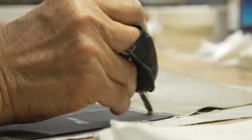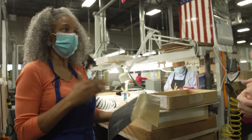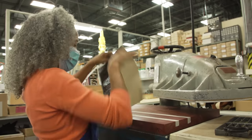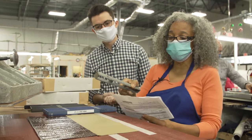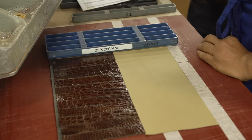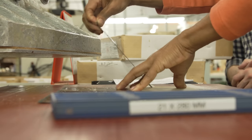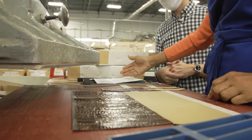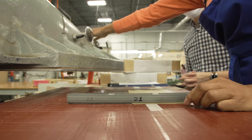This is all applied by hand. After it's sprayed, dried, and the stiffener is applied, we cut it. Then it comes to this machine where he puts it on with a template — this order is 16 by 16, so I need a size 21. This is for my single pieces; this is for my double pieces. He puts it on top of the material and chops it. There are different molds for every different size. If I do a 17 or 18, I go up a size and use a 22.